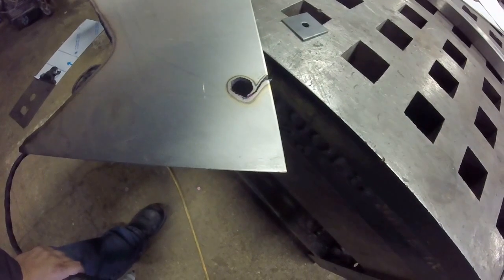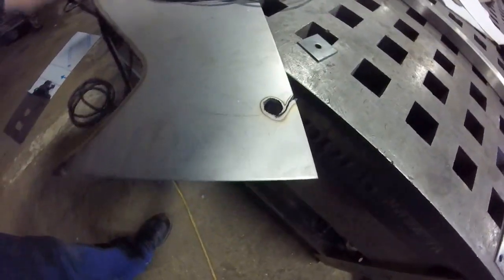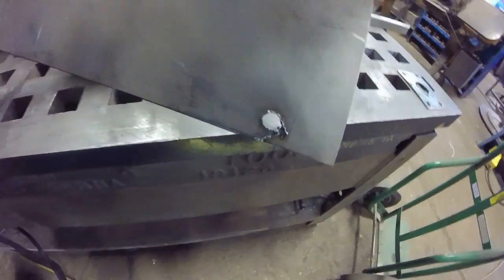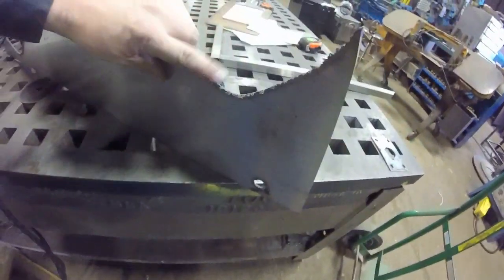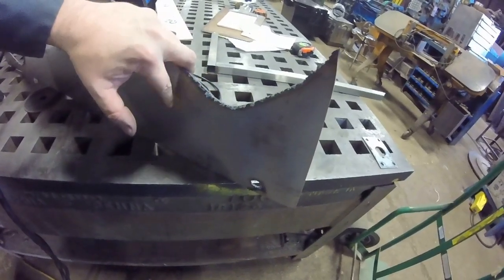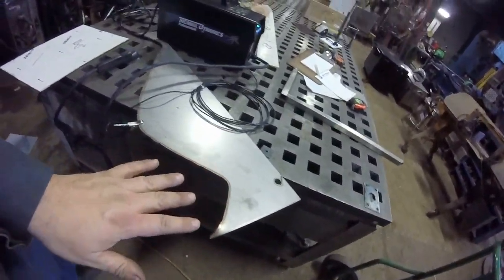She will certainly do eighth-inch stainless, but it's not pretty and it's really pushing the machine — you're not going to do it that fast. Stainless steel cuts really nasty, and this is actually slag built up from cutting with a bigger machine originally. But plasma does cut steel very cleanly.